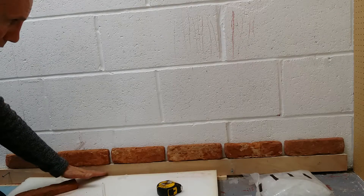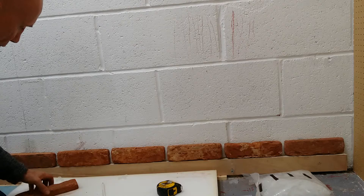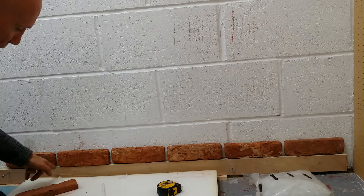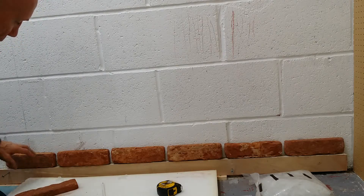I've put a ledger here which is a level exactly at the brick sitting on the floor plus one joint. So these are 75mm — the bricks are 65mm, allowing for a 10mm joint.